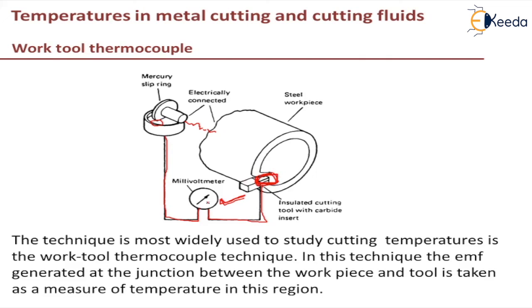As the junction is dipped at different known temperatures, we can draw a calibration curve. We read the output through a millivolt meter and do the calibration — so whatever indication in millivolts corresponds to a certain temperature. When subjected to actual cutting conditions, we can read the millivolt meter directly and convert it to temperature using the calibration curve. This concludes the measurement of work-tool temperature.